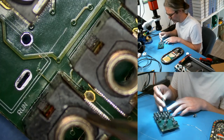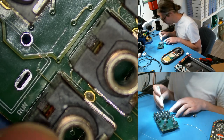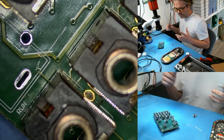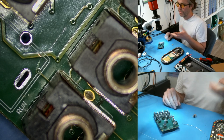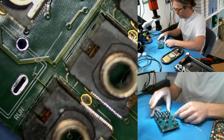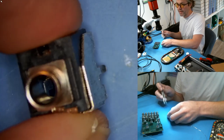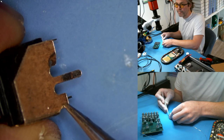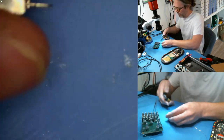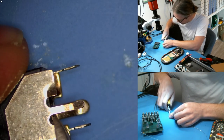Because the jack goes in at an angle, it's this piece down here that might potentially touch that exposed copper. So we're just going to trim that back a little bit. I'm going to take the bottom section off — trying to do this in front of the microscope, it's a little challenging. There we go. You'll see it's actually much sharper now, but it's short enough that it won't actually touch the circuit board. So we should be fine. That's step one.